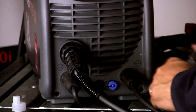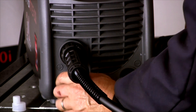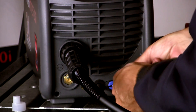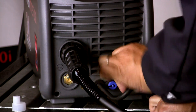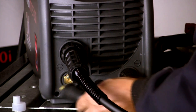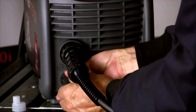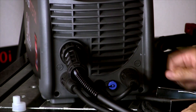This is my negative lead. If I change to flux core wire inside the machine, I want to change my polarity — so this is now electrode negative and my work piece positive. Now we're in DCEN.